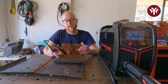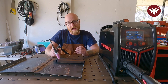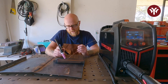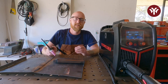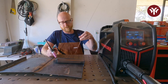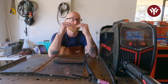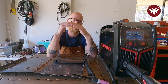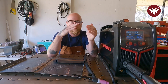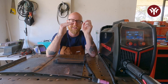When you get better at TIG welding, you won't have to stop-add-rod, stop-add-rod. You'll be able to have one continuous motion — just moving the puddle and adding rod, going down nice and seamlessly. For the bead pad, I recommend starting with MIG so we have those lines of MIG across the bottom, and then going over them with TIG on top. This creates a nice groove between the MIG weld beads for us to follow with the TIG puddle, so with the extra complexity of TIG we're not worrying about going straight — just move the puddle forward on the crease and add rod.